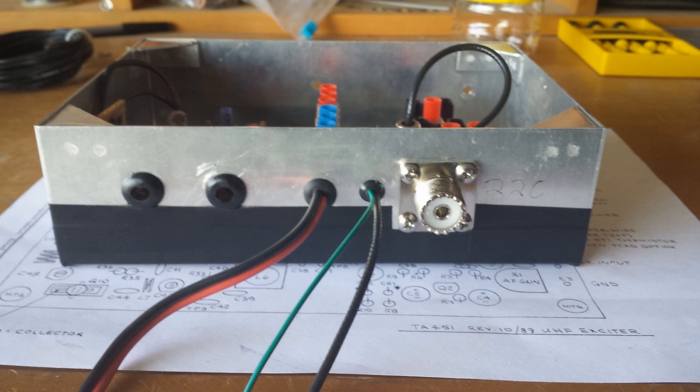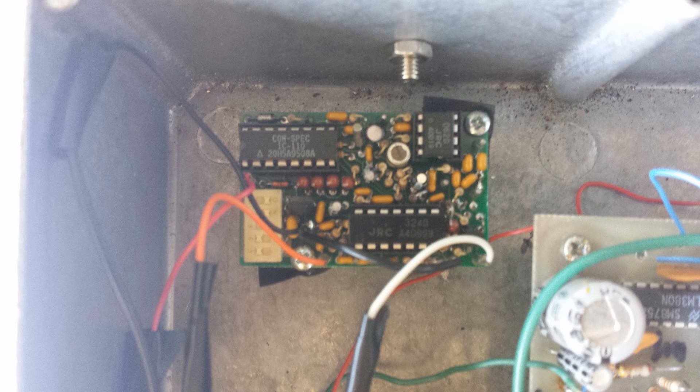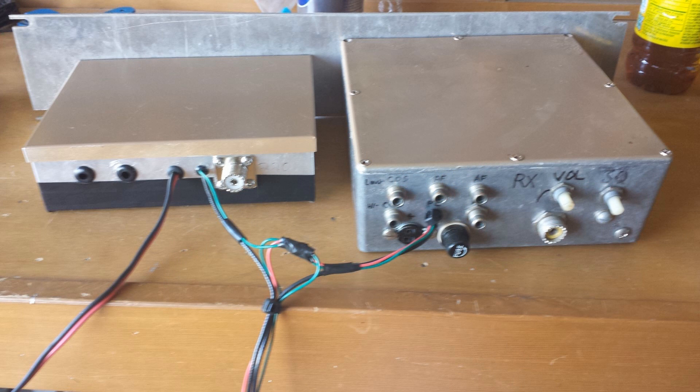While I saved the old chassis for the 220 transmitter and receiver, they were both completely cleaned up and rewired. I also installed a PL decoder directly into the receiver chassis. One of the issues in the past had to do with poor connections in the RF chassis causing various gremlins to manifest. This time I hardwired everything coming and going to the receiver and transmitter — may not look pretty, but it's solid.